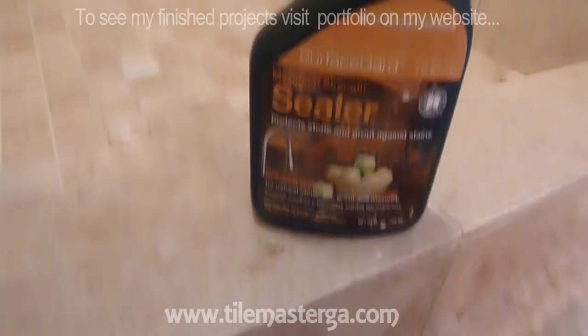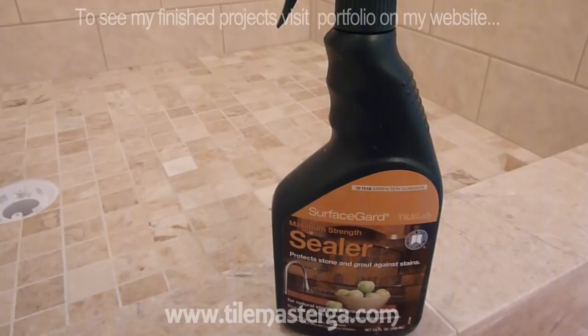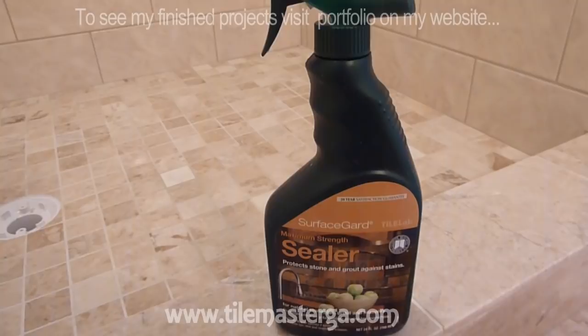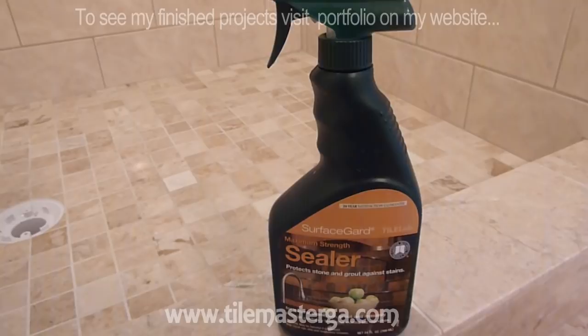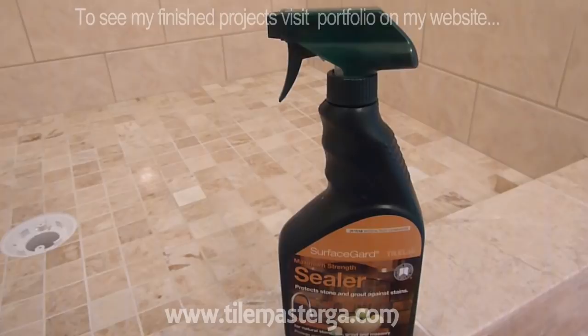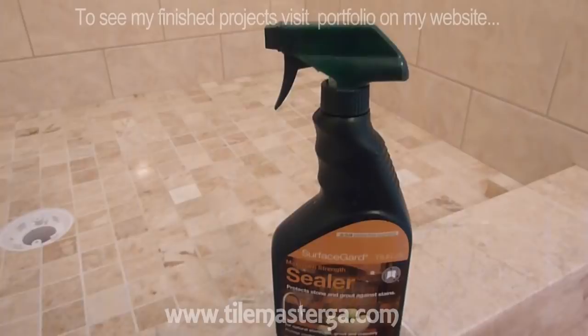Make sure that you know what you're doing, simply because there's a sealer and there's a sealer enhancer. Enhancer will change the color of the grout and will also enhance the stone. So if you want to keep the color of the grout and the color of the stone, please use just regular sealer. If you would like to enhance the color to make it darker or more vivid, then we use an enhancer. So there's a huge difference. The products look the same, they are both sealers, but many homeowners accidentally buy enhancer and then there's no way out. It's a permanent change. So this is it.